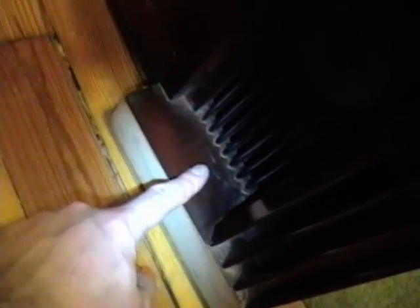Because there's no way I can get the legs off short of using a sawzall or a sledgehammer — not only are they screwed on, but there's also some biscuit wafers and pegs and they're glued on really solid. But I really wanted to refinish these because they were really dinged up. So what I did was carefully strip and sand these while not touching the upper surface. I couldn't realistically do that surface, but what I did from here down I'll be able to mask off this whole rectangular area when I spray the rest of the cabinet, which should be fairly easy to do. That just leaves me with the challenge of matching the new finish to this color as best I can.